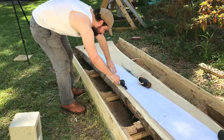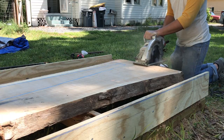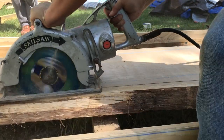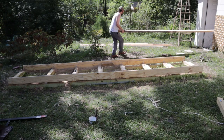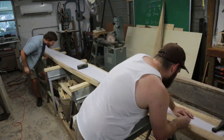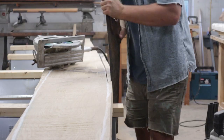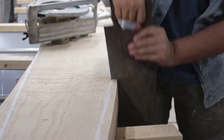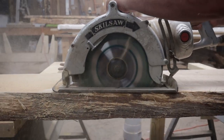Now it was time to start cutting the keel from the slab. We positioned the template so that we avoided the most defects and got the best piece of wood possible for our keel. At first, we're doing a real rough cut of the keel — mainly just trying to reduce the weight so we can move it around more easily. We then retraced the template so that we have a clearer line to cut to. Because of the 10-inch blade on the skill saw, we can't make the turns quite as nimbly as we'd like, so occasionally we have to come back in with a hand saw and clear out some material to change the angle of approach. Nonetheless, this is not the final cut — we're leaving some room to come back and shape it by hand.